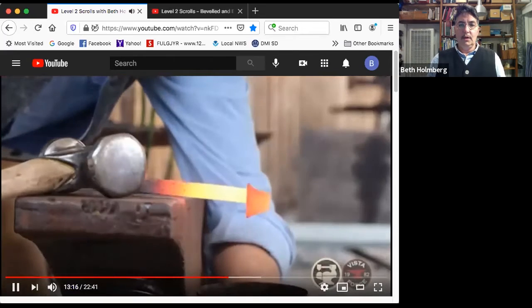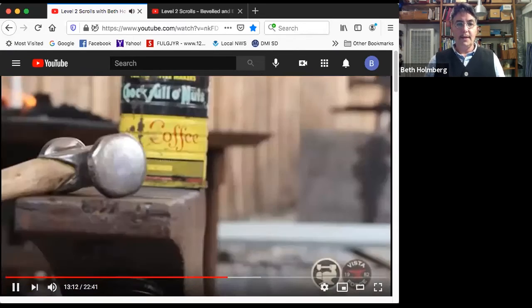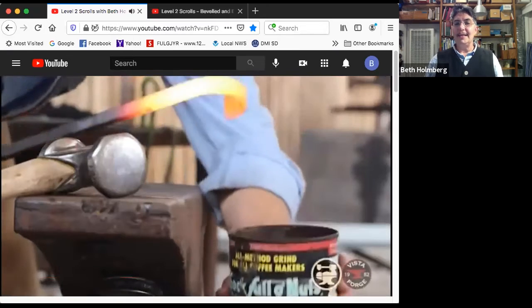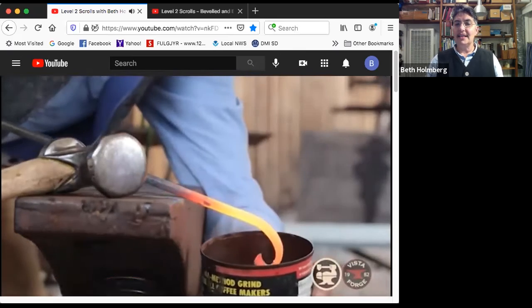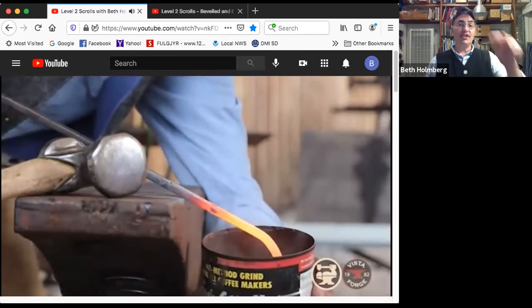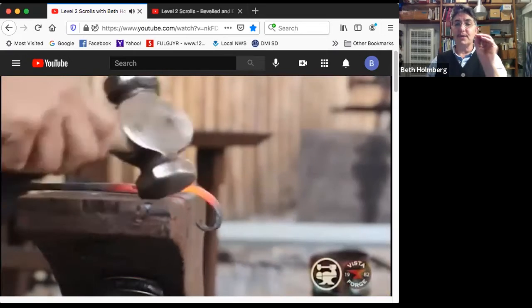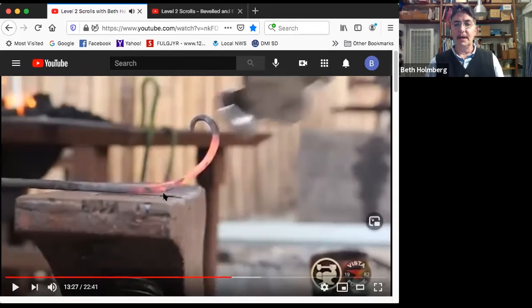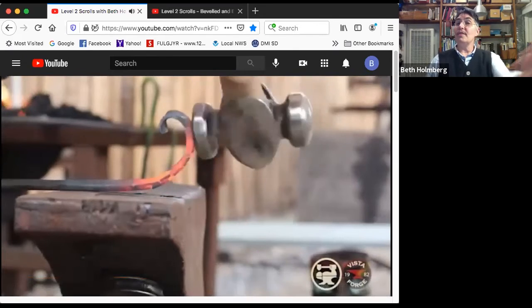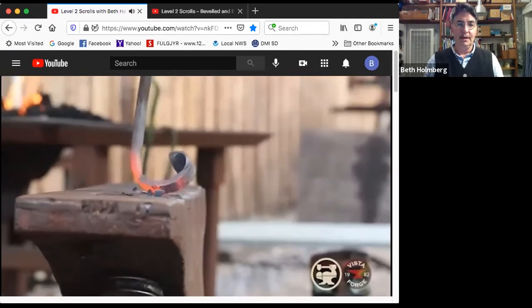Okay, so, sorry about that. I like the center, but I need to scroll more. So I'm going to lock the nice part in by quenching it. If I take the heat away, it can't change. So now that's protected and I can move the scroll down. There's a kink. I put a kink in. So now I hit up here and this whole section is going to bend, which is where the heat is. But the center is not going to do anything weird on me.